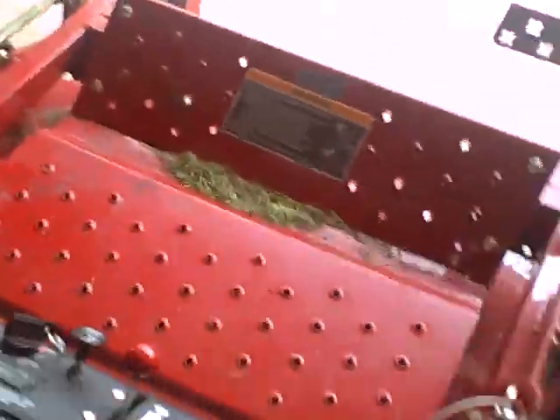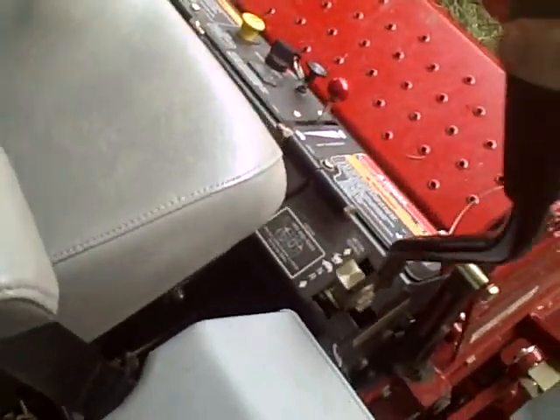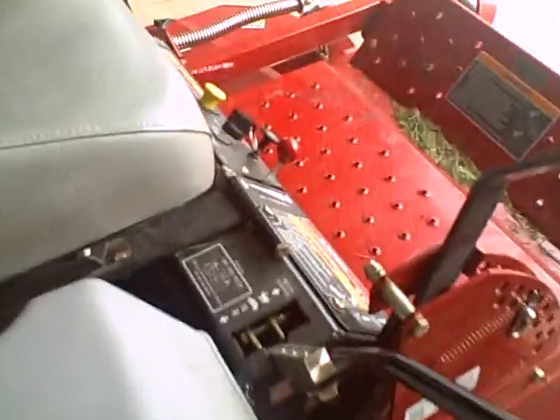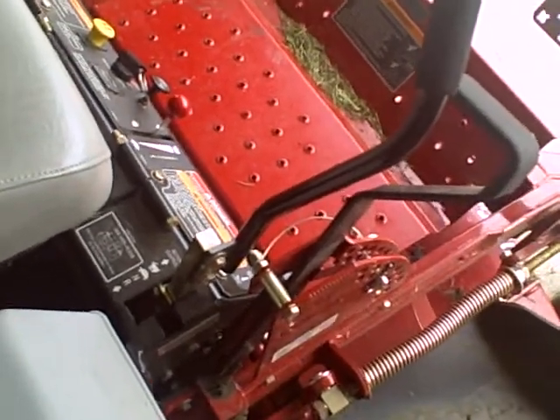As I use the two levers, these are actually valves. The valves open and close to allow or reverse the flow of hydraulic fluid. So once I go forward, the valve opens and turns the impeller in the motor, and it turns the tire. That's how hydrostatic works. On different mowers — like your average lawn mowers — there isn't two motors, usually there's only one, but it works the same way.